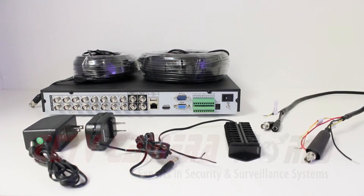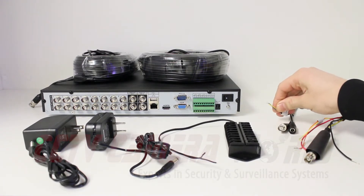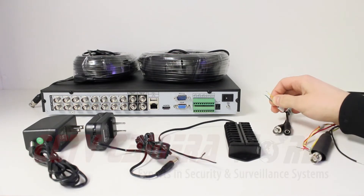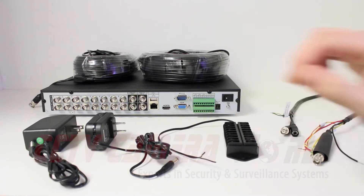You may have noticed that we don't have a CAT5 or CAT6 wire in this demonstration. This is done intentionally to eliminate any problems that might occur while running your RS-485 data connections over that cable. So to make things more simple, we're just going to take the RS-485 positive and negative and connect it directly to our terminal block.